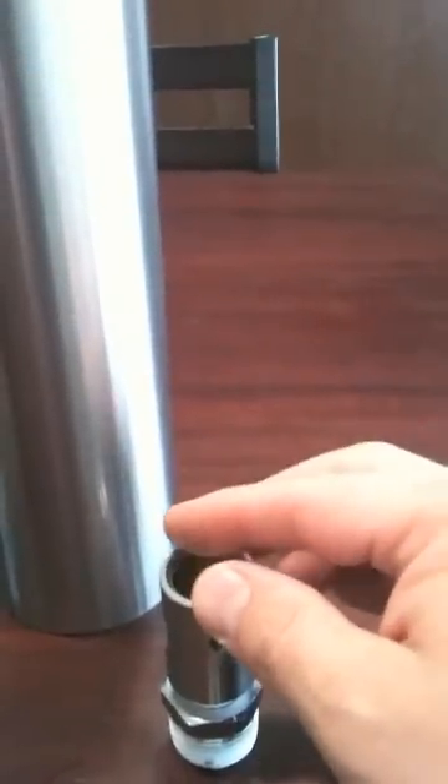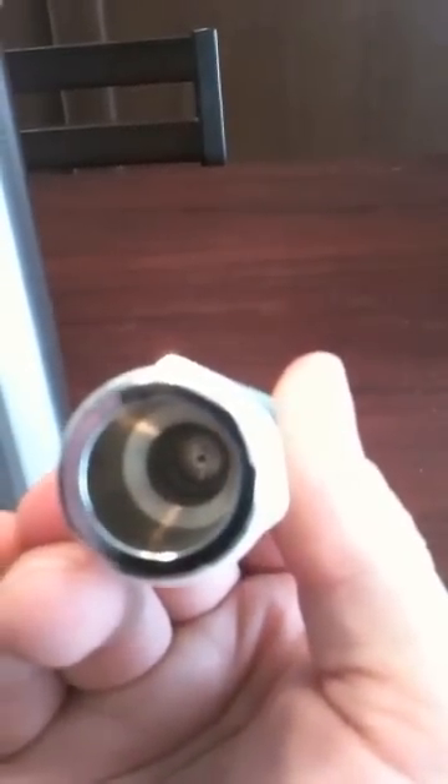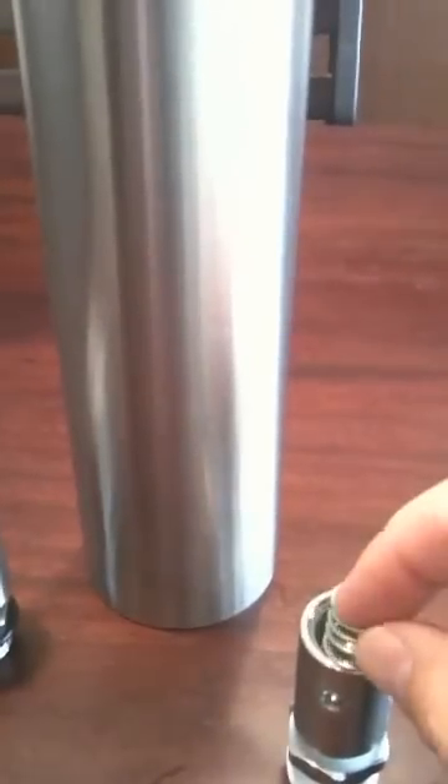The spring can be any size that you want added to the system. The heavier the spring that you have, the more pressure your system will hold. Here is the stainless steel ball — the stainless steel ball drops right down into the system and it closes up the hole in there perfectly. You can then add the spring back into the system and then close the flashback arrester itself.